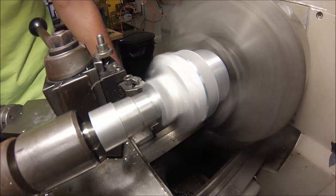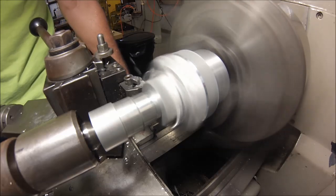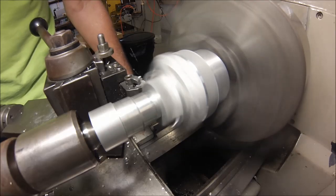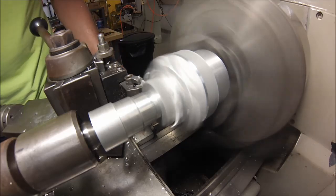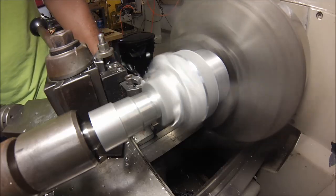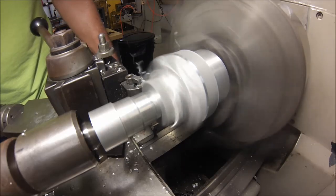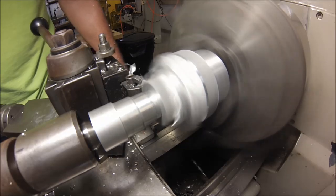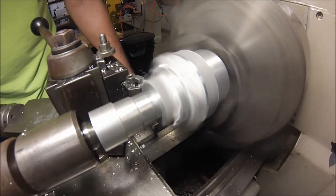I've got an awful lot of parts here, so let's see what happens when we fire up the machine and start turning. This will go all the way down — I measured it on the bench at 0.875 inches. This particular driver is going to jump around a little bit; I'll release some of the tailstock pressure and you'll see it center up, then I'll reestablish the pressure to continue the operation. The crunching you hear is the individual laminates breaking off to the next layer down — maintain pressure on the tailstock, be patient, and you should have lots of luck.